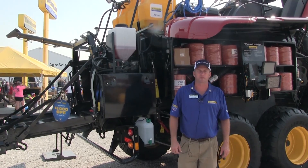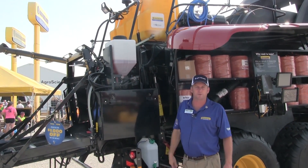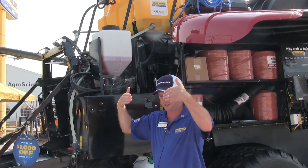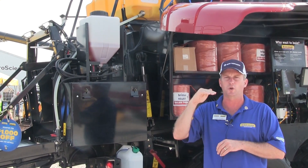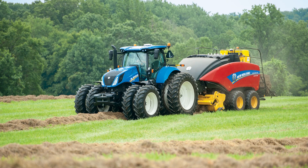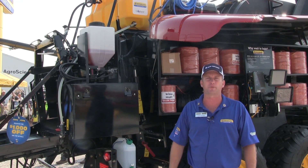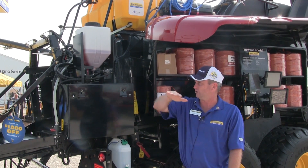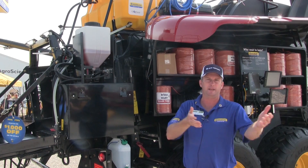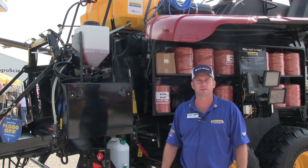On this new model year 16 big baler, we have a few other new items. One is called a dye marker kit. This reservoir lets you pick the color you want to spray on the side walls of your bale. There are three nozzles on each side of the bale chamber, which you can see right here. You set a scale inside the controller — for instance, at 100 relative feed value it sprays one line across the side wall, at 150 it sprays two lines, and from 150 to 225 it sprays three lines. You put those three numbers into the computer and it applies dye to the side walls. So you can look across your field and immediately tell which bales are heifer hay, which are dry cow hay, and which are good quality dairy hay, allowing you to sort and stack them right from the field.